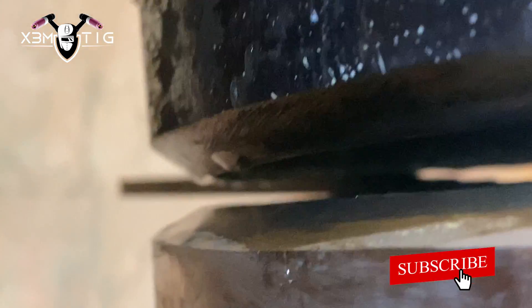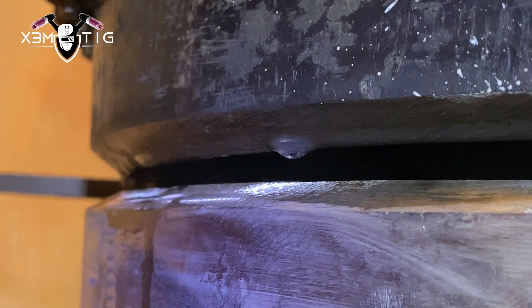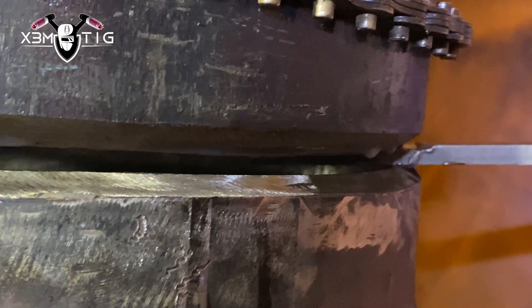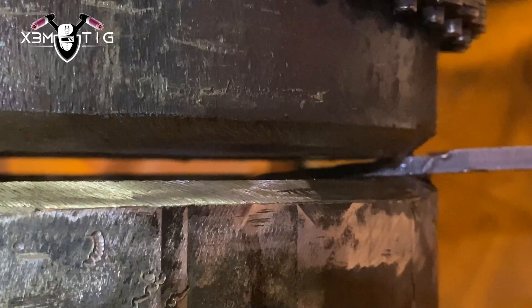Steam is coming out and creating water that is condensating on that pipe. The pipe is still hot but the surface is cold, which is why we've got water. There are a couple of things we're going to apply here to prevent that while we're welding. The unit is live and the pipe is still shaking and vibrating from all that.